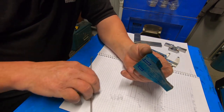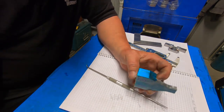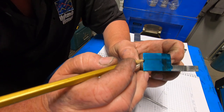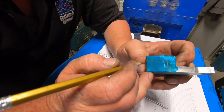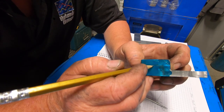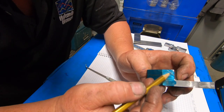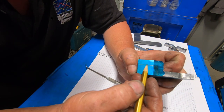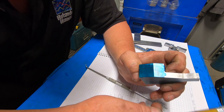So I'm thinking, instead of trying to slot this entire width, where you can see it there, try and get it in the right light this way. Yeah, so the line goes across there and then down there, and then put a chamfer on this side here just for a cosmetic show. But take all this bulk out of it. Still going to be plenty strong enough, not going to bend it. I think it'd be a lot better off.